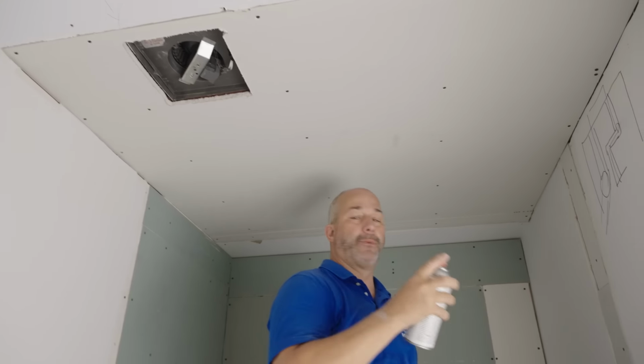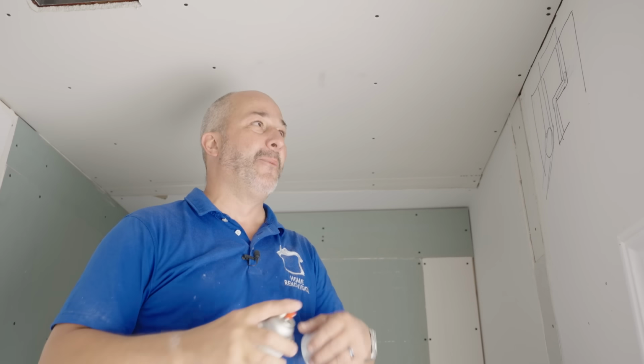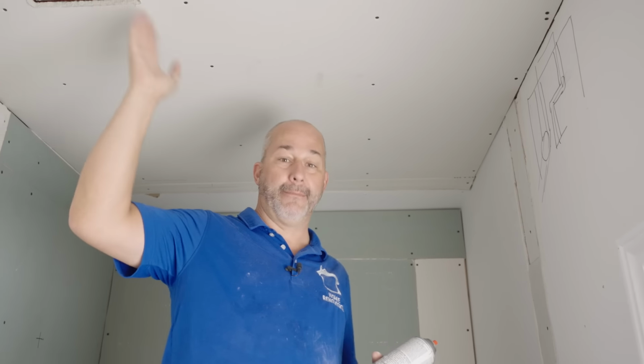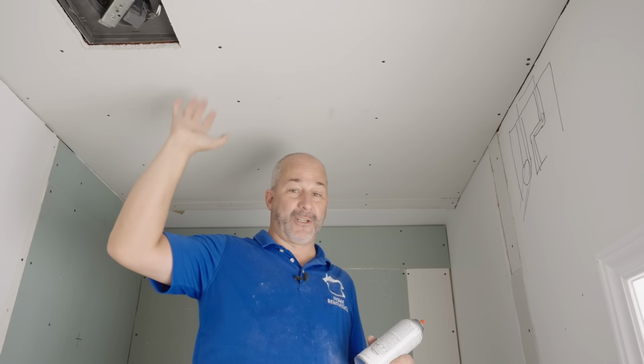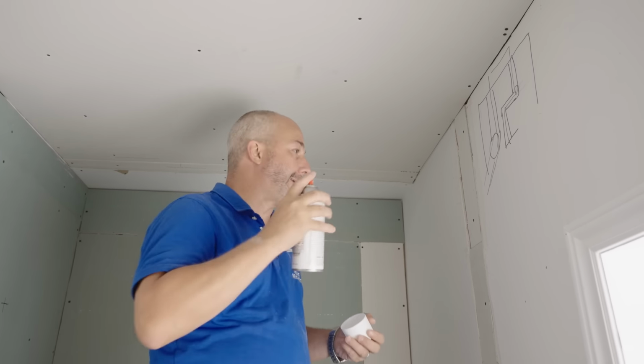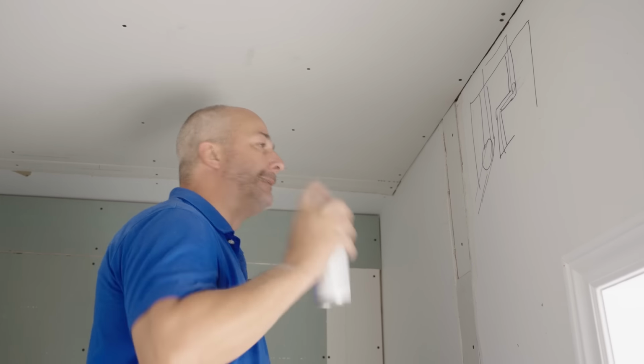All right, and that's the wrong time to find out that the hole is too big when you're done your project. Maddening, because you got to go back with tape and mud. Or it's just going to be a disaster to break off and come out. Fans vibrate, so the tape will crack, or the mud will crack if you just try to patch it quick.